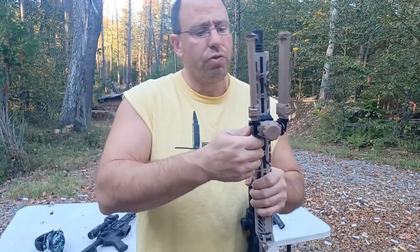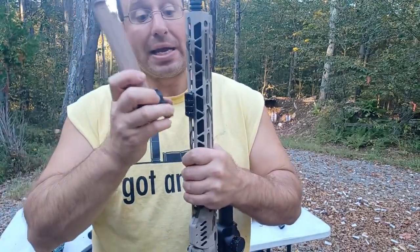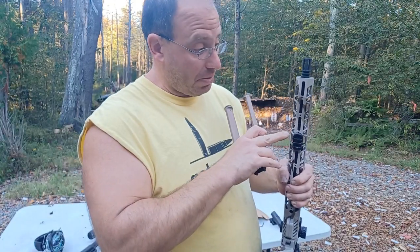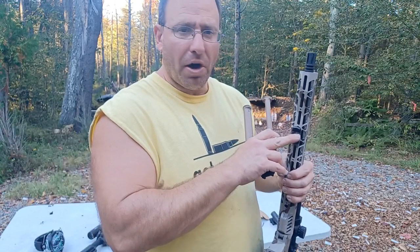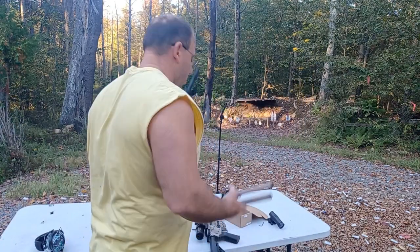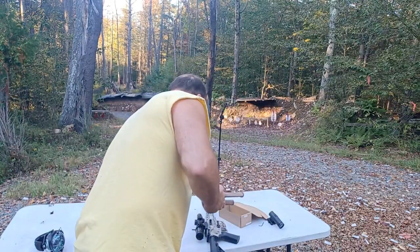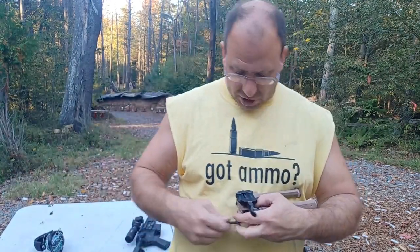So when I loosen this up, on this one I can kind of get it off. But here's the thing — this isn't necessarily a problem with the bipod itself; this might very well be a problem with the tolerances on these three-slot rails, because on this one I can kind of get it off once I finger-tighten it, but on this other one once I finger-tighten it, it won't come off so easily. I don't think it's that big of a deal, but it's something you guys should definitely be aware of.